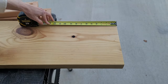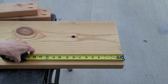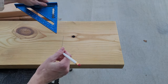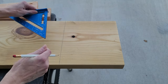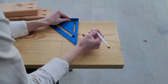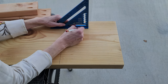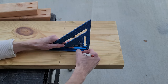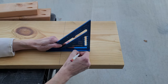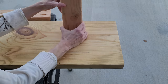To mark my leg spots, I flipped the board over so I'm on the underside and I marked in 10 inches on each side, then drew a line. I went 10 inches in and then measured two and a quarter inches from the edge. These are the lines where I'm going to set each leg so I can attach it with some two inch screws. You can adjust these locations if you want. I felt comfortable with this for the function of the bench, the stability, and also aesthetically how it looked where the legs were located. But you can customize this part if you'd like.